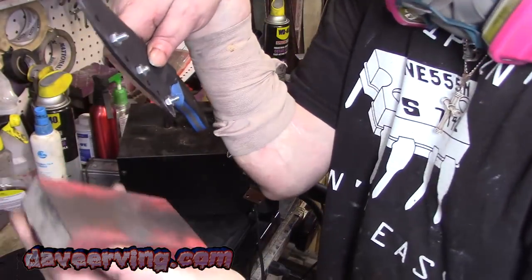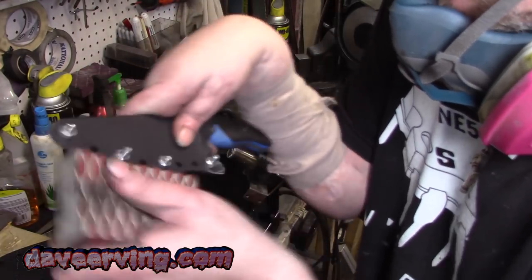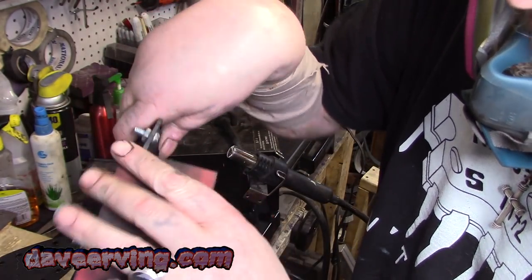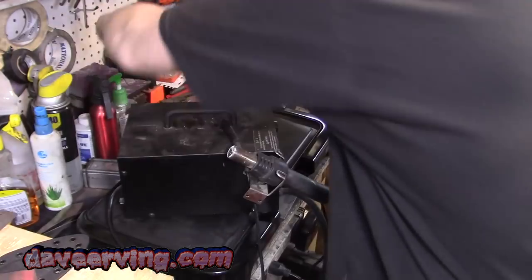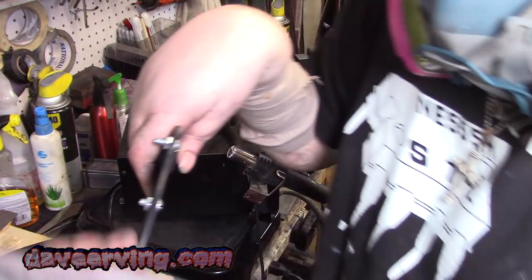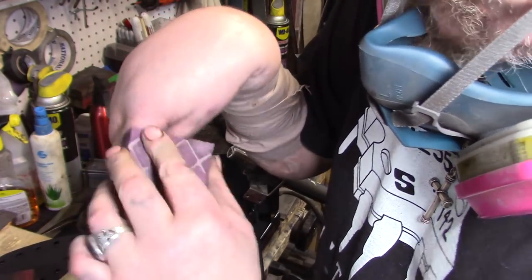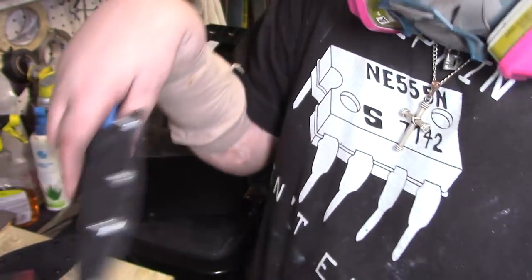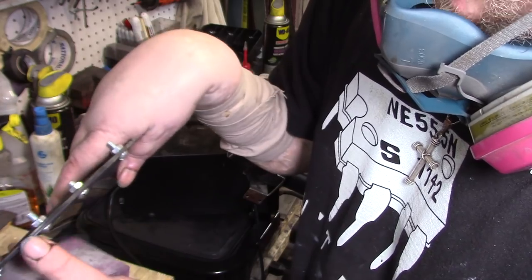You can see how it's a bit black from doing it — I think that's actually from carbon fiber. Just take it and smooth it out. Any notches like that you want to make sure you get out. You might have to go down a lower grit — like an 80 or 120. That's why I get a bunch of these sanding blocks — they're great for kydex and great for hand sanding. See how smooth that's going to be.